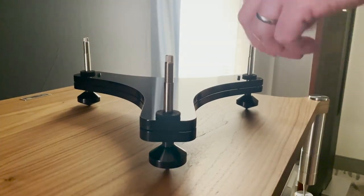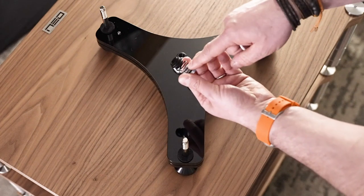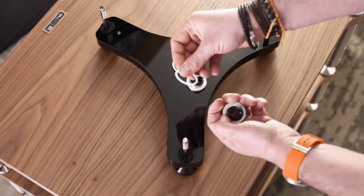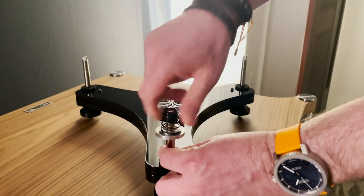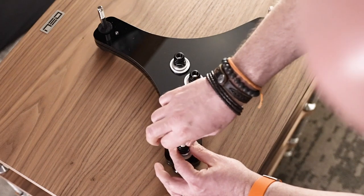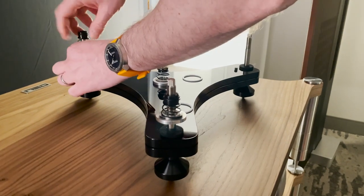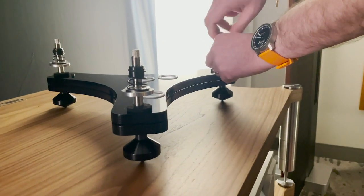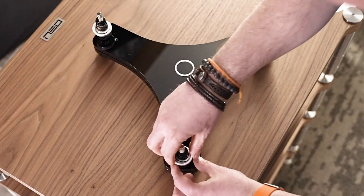This is a suspension spindle and this is a suspension pillar. It pushes over the top of those and will not move freely because it's sitting on the three balls in there. We now need to put the springs on top. We have a chrome-plated spring which is rubber-coated with a plastic bush at the top, and a PTFE protection washer which goes on afterwards. Screw the three springs into position — just gently to the bottom of the threads but not tight. Then place the three PTFE washers on afterwards.